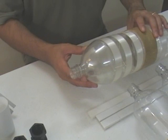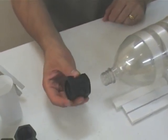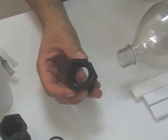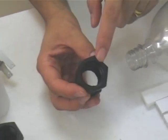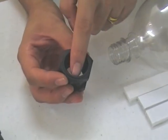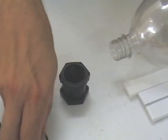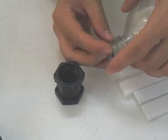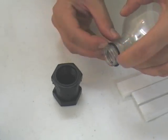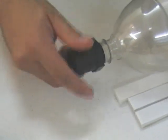These bottles are joined with tornado couplings, and these are just made out of three-quarter inch polypropylene BSP sockets. What we do is re-thread them to fit the bottle thread. We also machine an o-ring seat in there. So this is how they go on — we first put an o-ring into the bottle, and then the tornado coupling simply screws on.